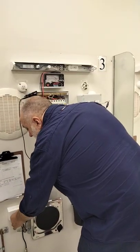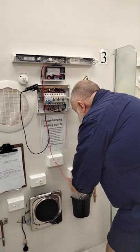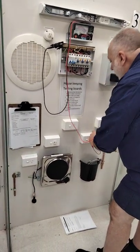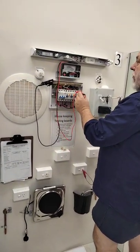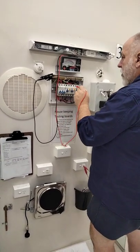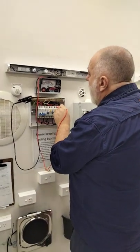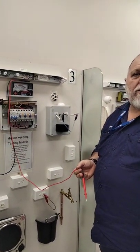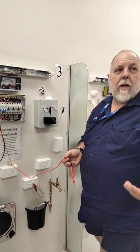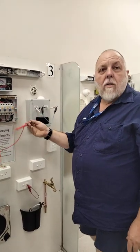Make sure the switch is turned on too. I'll turn that switch on, come here, and do socket number four. Here it's coming up — reading 1.5 to 1.3 ohms. We need to write that down, then go to our book and compare the values to see if it passes. Remember we go to Table 8.2, look at the size of the circuit breaker — so this is a 16 amp Type C breaker — and then we make our notes.